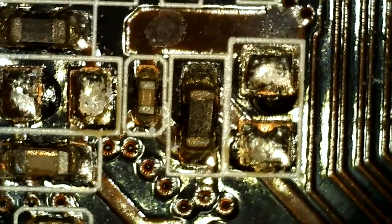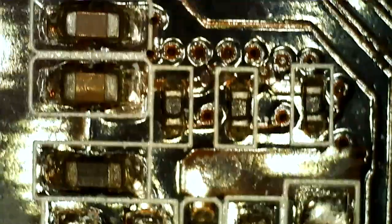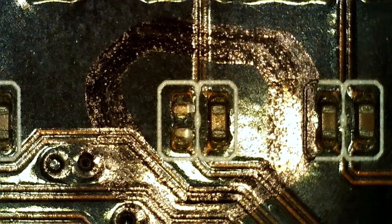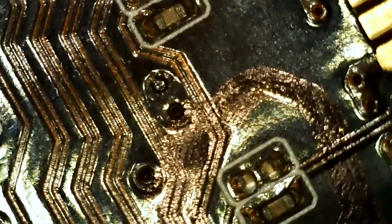Turn the card around. A bit oxidized and crappy, but yep. So there you can see the problem. If you have a 200 series at least, and you have those missing, and it doesn't post on some motherboards, it could be because of that. It will cause Gen 1 not to work. I suspect the same thing on this, but I haven't tried because I have to take the computer apart with Gen 1 then. I don't want to do that.